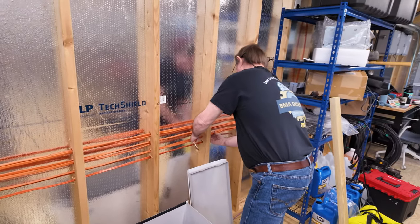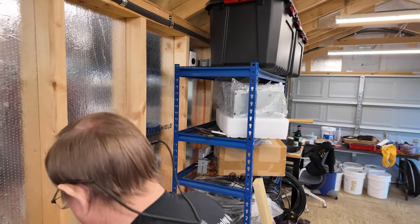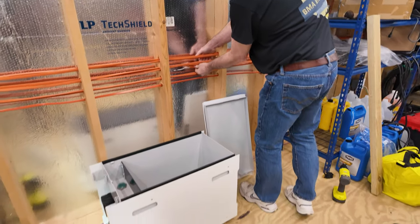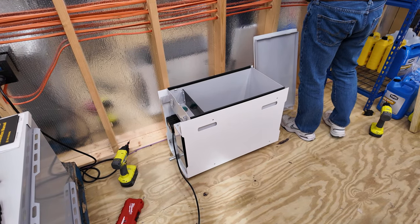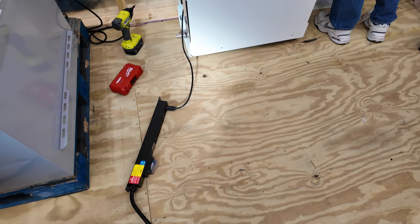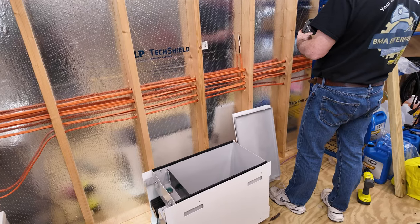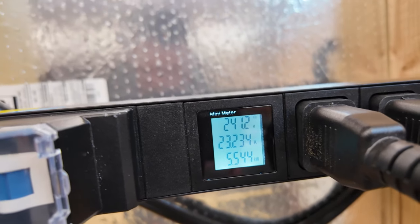And right now Dennis is moving one of the old outlets, which you can see there's three more of them tucked behind that shelf. And we're moving this outlet closer to where this Bitpod is going to be deployed. And this will allow us just to have better cable management. It'll allow us to mount that mining PDU right side up with the orientation and the length. Otherwise we're going to have to basically mount it upside down. And you may think, what do you mean upside down? The gauge on it only has one orientation. So this is right side up. And if it was the reverse, all the numbers would obviously just be upside down.